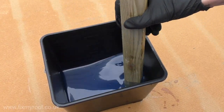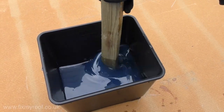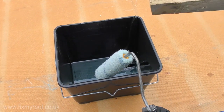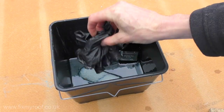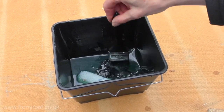A round mixing stick would be a poor choice. When you're happy that it's mixed, you're good to go. Multiple mixes can be made in the same bucket when empty, but when you've finished, leave any spare resin in the bottom. Old brushes or roller heads can also be placed into the waste mix, as these cannot be cleaned. The same goes for your disposable gloves if you have resin on them or holes in them.